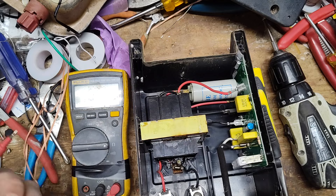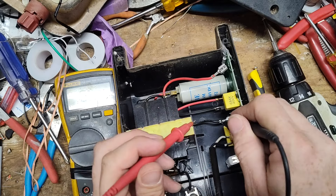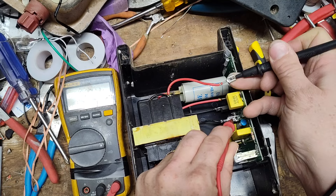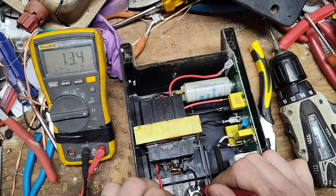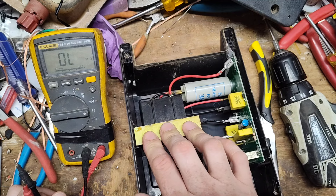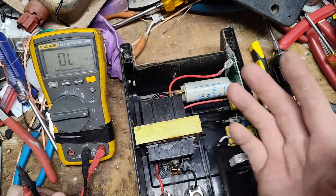You want very very low ohms on the primary — like 0.1 to 1 ohm. There's no polarity to continuity or resistance readings, so it doesn't matter which way the leads go. I unplugged the red wire to take it out of circuit so nothing on the board interferes. It's reading 0.4 ohms, which is fine — should be between 0.1 and 1 on average. Now testing the output ohms: that's 13.5 ohms, which is probably okay. Output ohms vary from model to model, anywhere from 4 to 35 ohms.